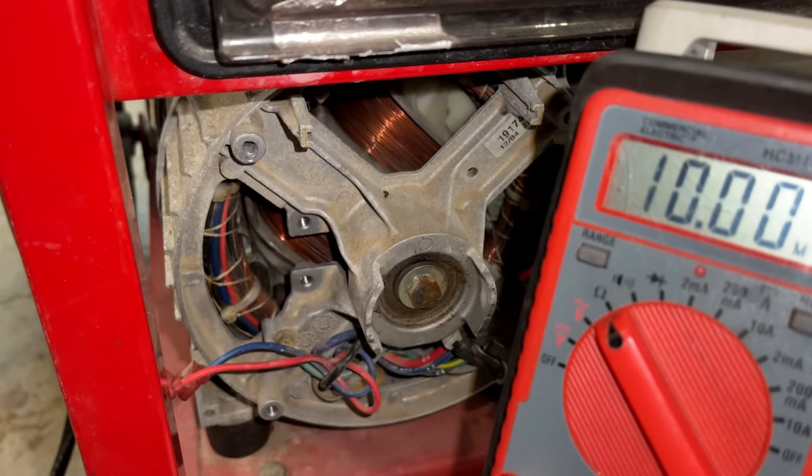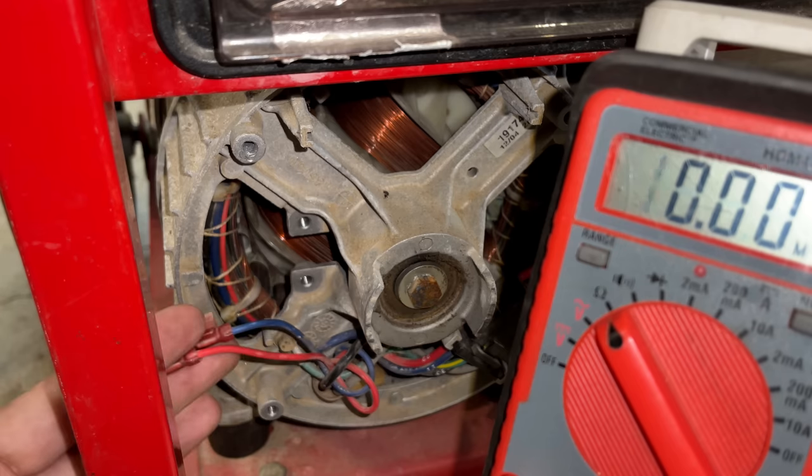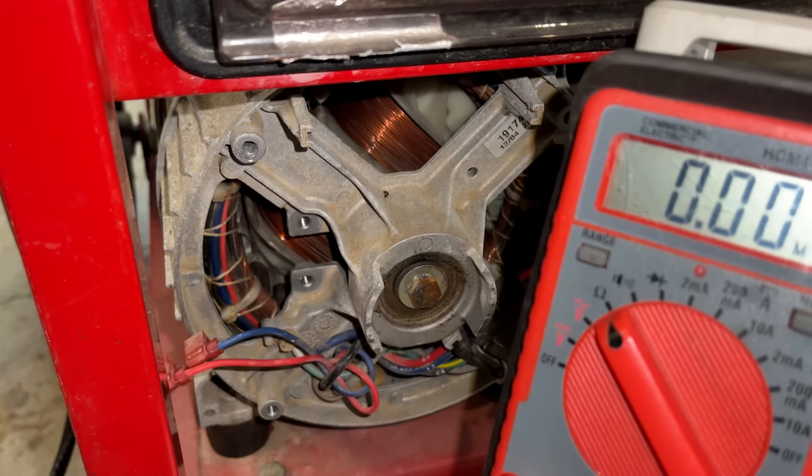All you need to make power is a good DPE winding and a good rotor. And that should power up the rotor and send power to the stator. Now, if the stator was bad, you would then have a meltdown. But given we have a good DPE and a good rotor, it should be trying to power up. So I think we're still on the right track here.